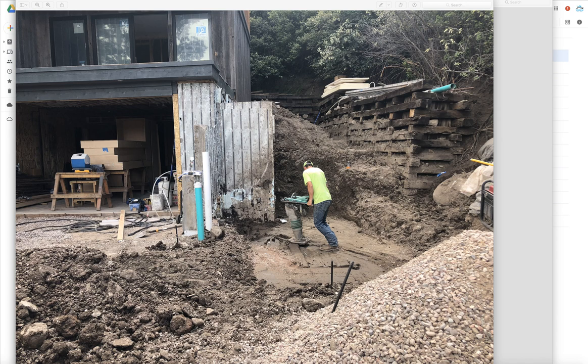Here's a shot of that side of the garage. So this will all be graystone, Gil — graystone face, graystone here. And here's the staircase: it comes off 14 feet out here, and then goes up. It's a three-foot-wide staircase. Then we have a platform, and then four steps up to the guest master patio.